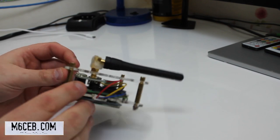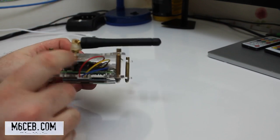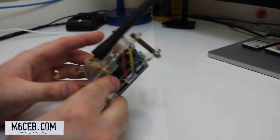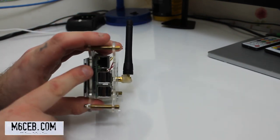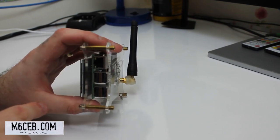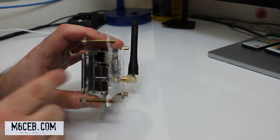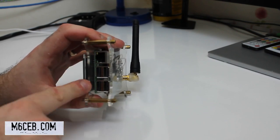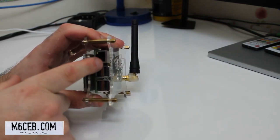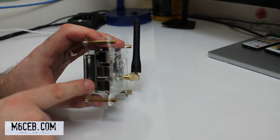You've got the little antenna there. I've got a 90 degree connector so it's pointing upwards. There's an ethernet port on the Raspberry Pi — I like to hardwire it into my internet, but you can use Wi-Fi. You can also tether this to your mobile phone using Wi-Fi tethering. You connect by ethernet first to program your Wi-Fi details, then put your phone hotspot details in.